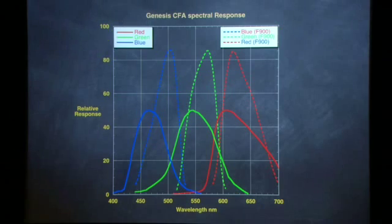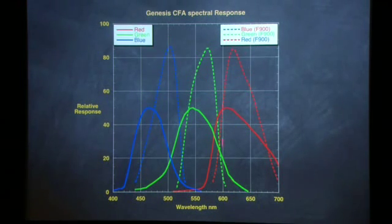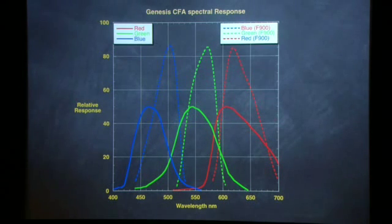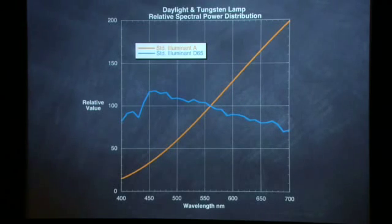This is a two-thirds inch camera that uses a prism, and two things are immediately obvious: the slopes are much sharper, the crosstalk — the crossover regions — are much smaller, and they're much narrower. But they're also much more efficient; we're getting close to 90 percent. So when you're building a camera with a color filter array, because these are pigments basically literally lithographically printed on top of the pixels, the choice of color saturation of these devices determines the sensitivity of the camera. We get away with that for a reason I'll show you later, which has to do with the Super 35 millimeter sensor size.